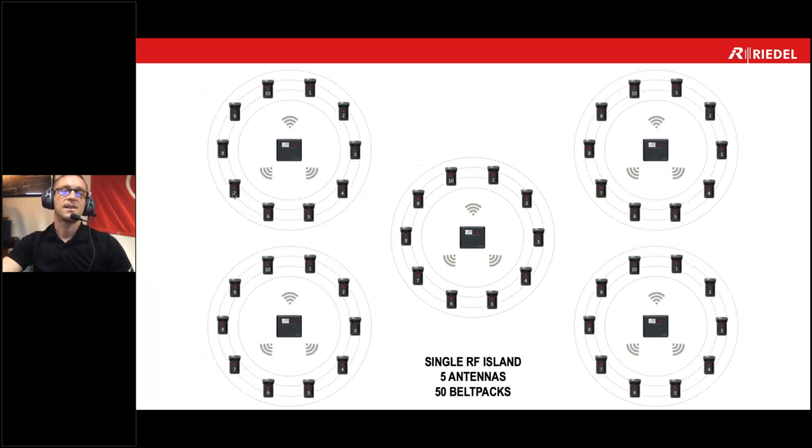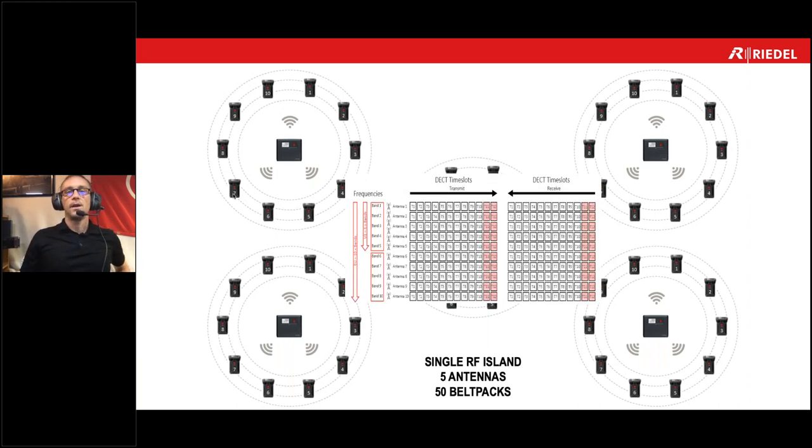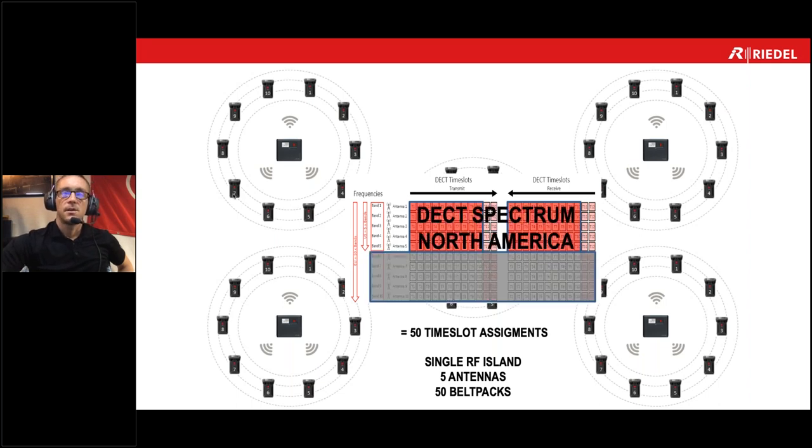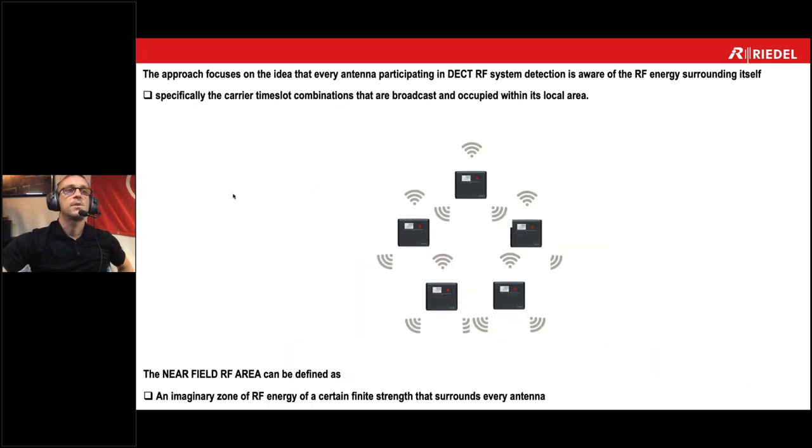So we got 10 time slot assignments, right? We got five antennas, so we can get to 50 belt packs, five antennas. Easy, simple math. And we got our normal DECT space to work with here in the US. He's got some fancy animations here. That's all I got to say. So we can see that in this single RF island, we have all 50 time slots occupied, right? We can agree on that one. 50 time slots are assigned. North American space, we don't get anything else to play with.